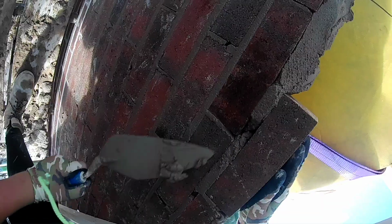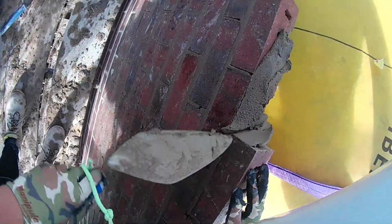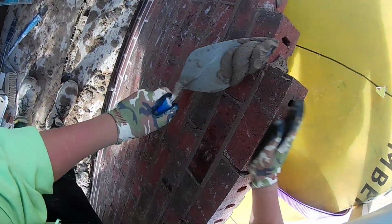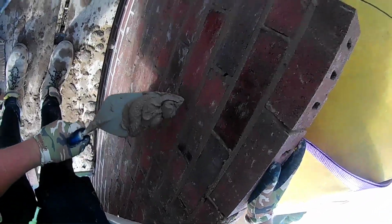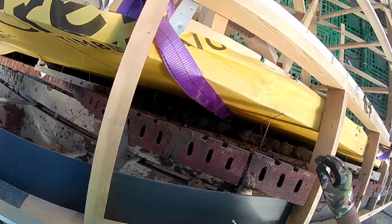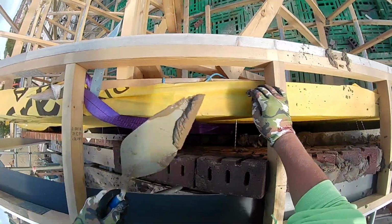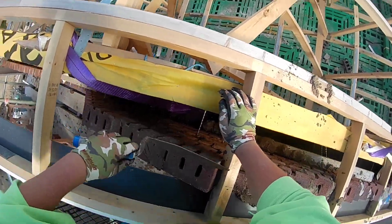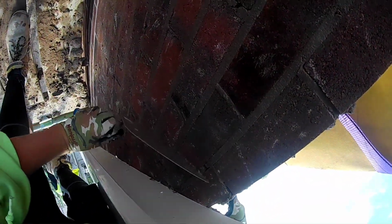I have been a bit finicky with the top and tailing and the brushing off, but recently, it makes a good job on these concretes if you give them a good strike, a quick brush off, and they look pretty good. The joints aren't as nice and sharp as if they'd gone off a bit stiffer before you brush them, but it makes a good enough finish, I'll call it, and that's what I'm getting my head around now. On this site, I'm trying to make a good happy medium.